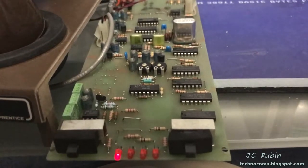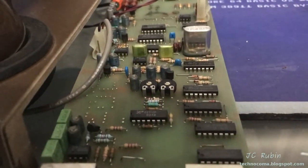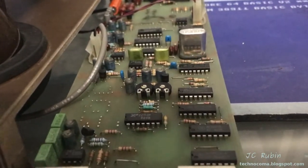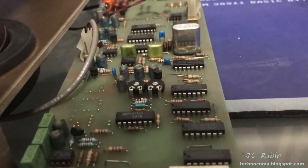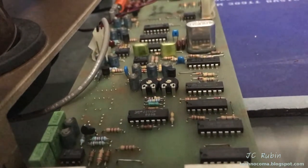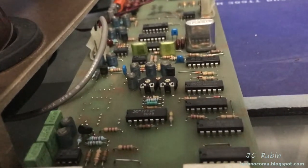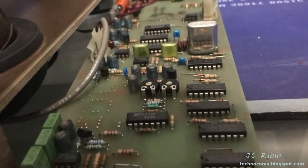There's no documentation for this and I've done a movie before. It basically comes down to these two potentiometers that I'm imagining allow for some swing in the transmit and receive frequencies. I'm working on this right now. There's an auto test built in, but if you get it calibrated for the auto test it doesn't mean anything in the real world, and that's what I'm finding.